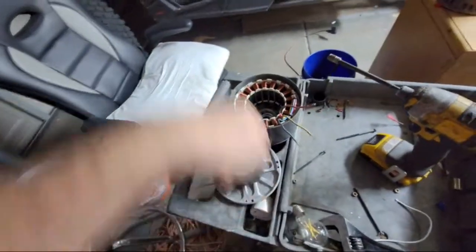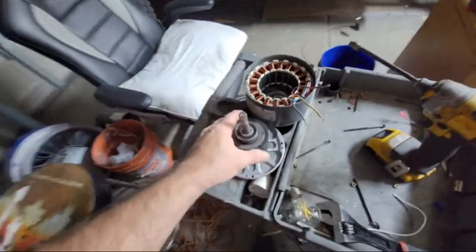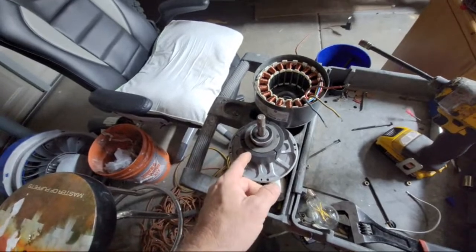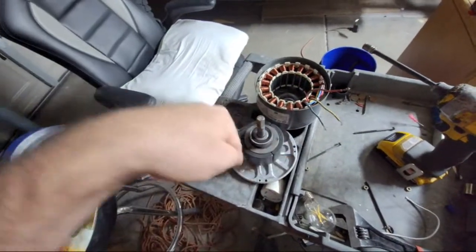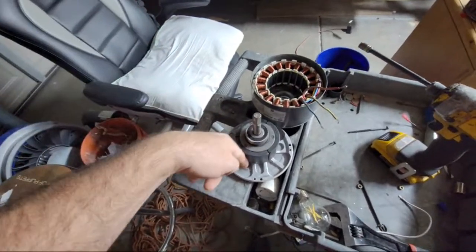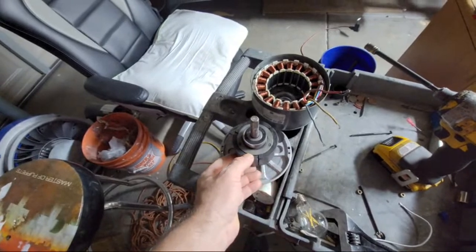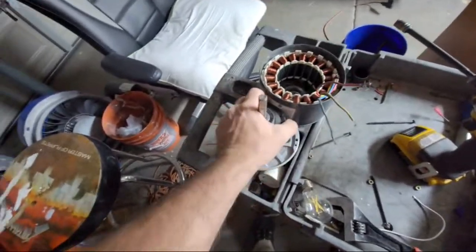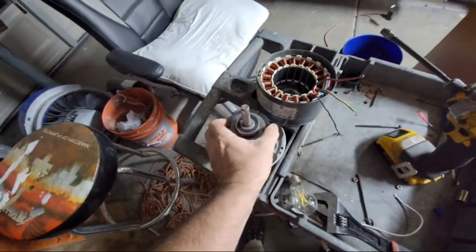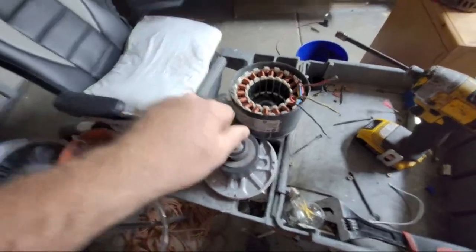You're always powering two of the magnets, and one's unused. As this is rotating, there's always an unused one next. As you pulse one, the microprocessor, it just happens to work this way, the one that's not being used, you're looking at it for that zero cross, and right when it moves and zero crosses, it's ready to now do these two. Then it rotates a little more and sees this, and that's going to go to these two, or whichever way it goes. But that's how it works.